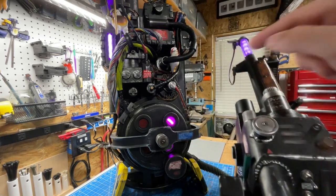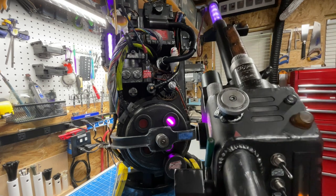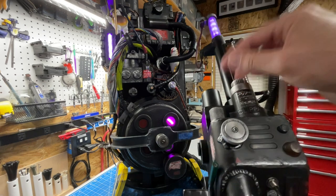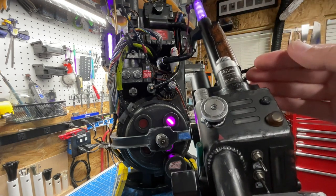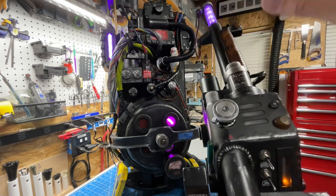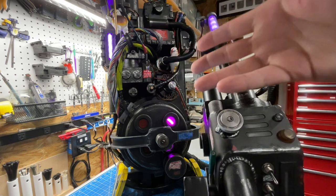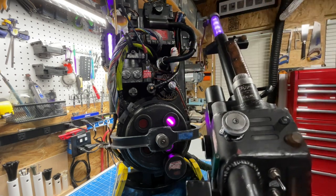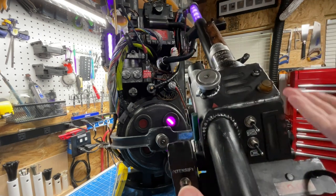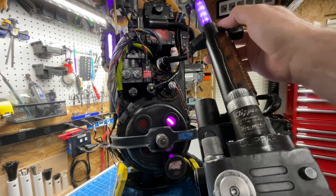Pressing the intensify button changes the inner cyclotron LEDs from RGB to GRB. If you look at the specs when you buy your inner cyclotron LEDs, the manufacturer should state the color pattern, because some that have been purchased are GRB — we need the software to flip the red and green colors so everything looks correct. Press the button once and it flips to GRB; press it again and it flips back to RGB.